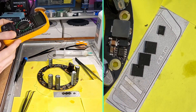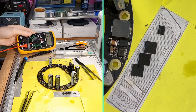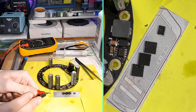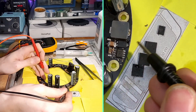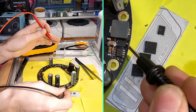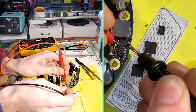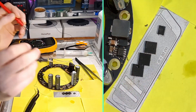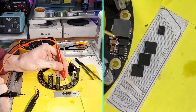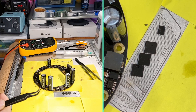You can test the diode while it's still on the board by putting your multimeter into continuity test mode, where your meter gives you feedback when a short is detected. Then put one lead on one end of the diode and test both pins on the other end of the diode with your other lead. Usually when it's bad it will show shorted on both anodes. It's a good idea to test the diode again once you have it off the board to verify the diode itself was your short and not something else on the board.